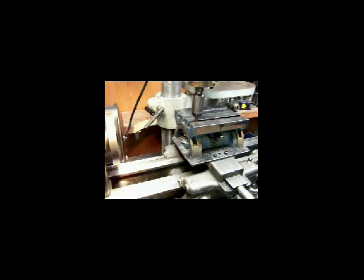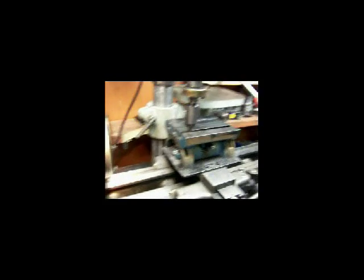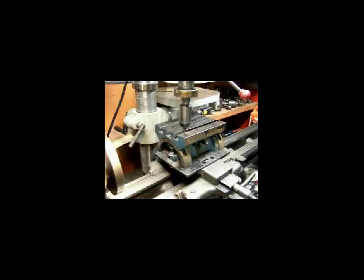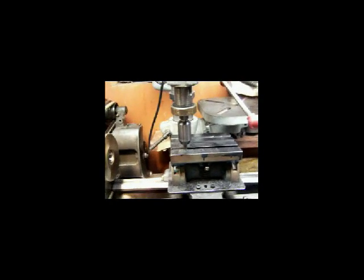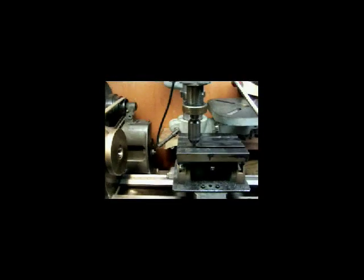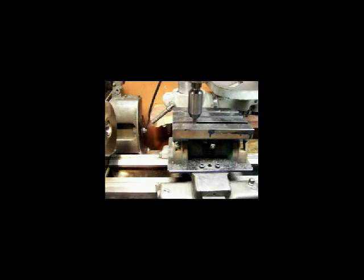This is the next part — since the bottom of the T-slot has been widened, I'm now widening the top of the T-slot with the middle cutter. There's a little shakiness in the whole machine, but what are you going to do — I only paid fifty dollars for this drill press. A little work, a pipe, and some milling, and we're going to have a bed to lock things down on and do milling with.